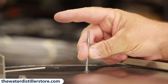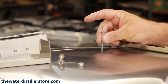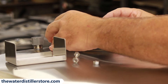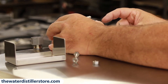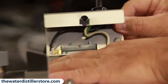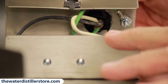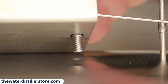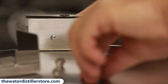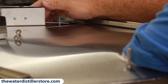After you get your spring on your float, it's time to mount your switch box. The first thing you do is slide the switch rod through the spring. Here's your switch on the inside — you put a bolt down through that hole, and that hole goes in the tank right there. You just slide it down into the hole and take a nut, reach in the tank, and tighten that box into place.